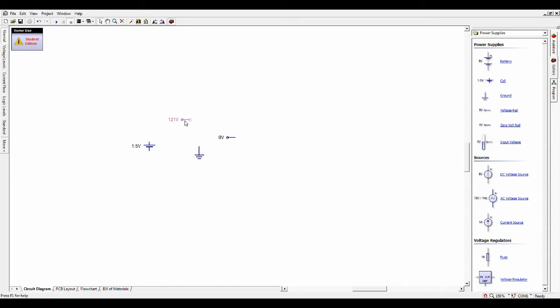That is a very high voltage. It's actually only DC voltage. You can get an AC voltage source, which you can set the frequency and the RMS voltage value of. You could easily emulate mains voltages. In the UK it's 230 volts at 50 Hz, and out of there would come said voltage at said frequency, and you could essentially measure it.